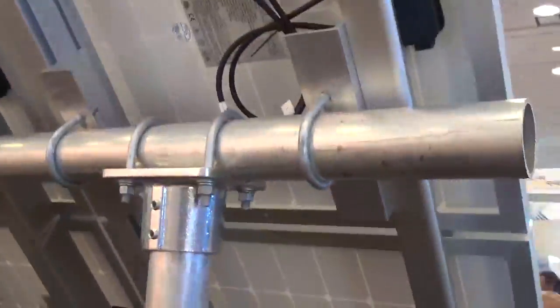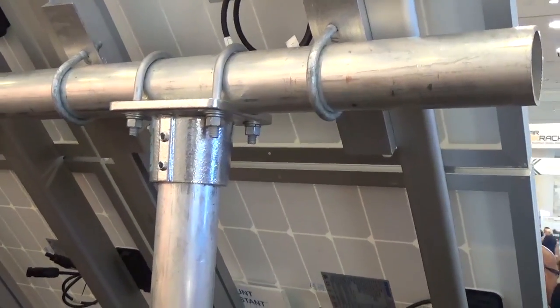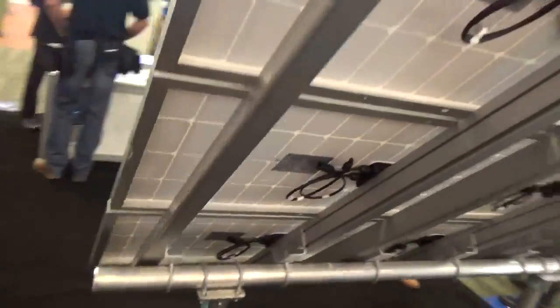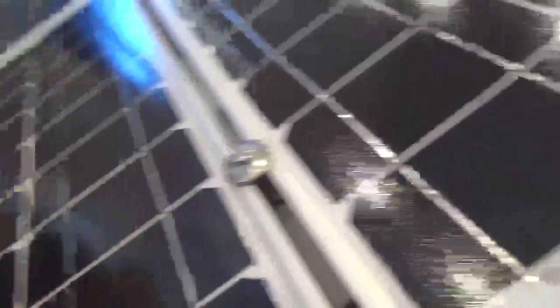Just having a fun time looking at all different types of racking and ways to mount solar panels. I'm going to do some IronRidge — I've always seen them, they're very simple. Jason Andrade at West Coast Sustainable has been using them a long time. A lot of times I do top-of-pole mounts and then switch to a ground mount, but I need something in between. The IronRidge is probably the easiest — just using regular two-inch and three-inch pipe with couplers and clamps to adjust your angle. They've got a configurator that makes sure you do your concrete foundation base right; you can also mount these on a roof. This is something I want to do for some of my bigger solar water pumping projects.